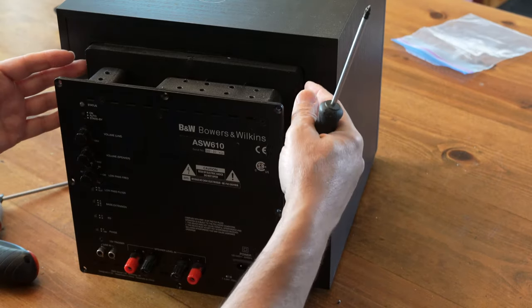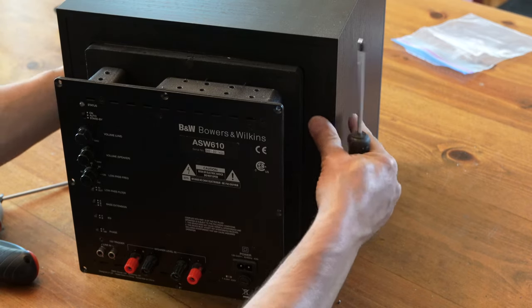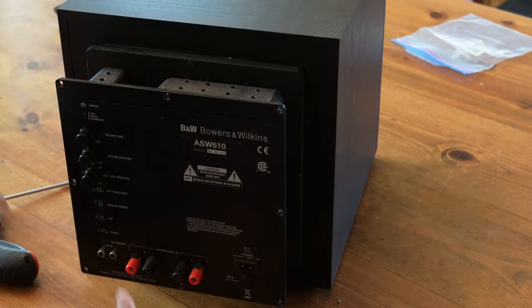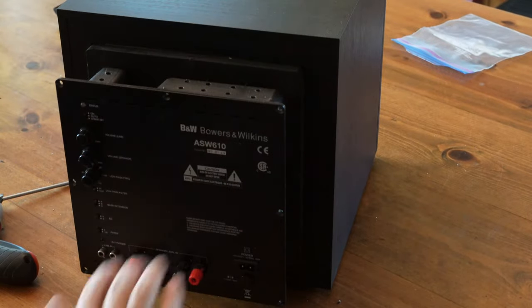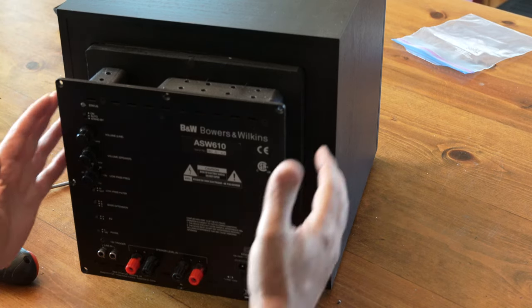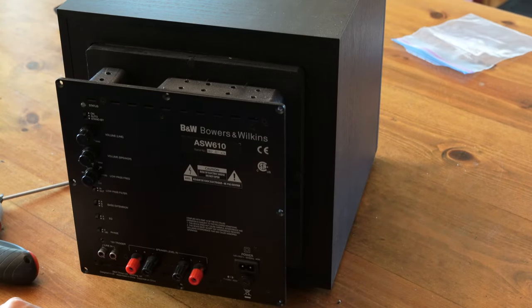The other thing is it's no longer inside being hammered by the vibrations. And the third thing: we gave the volume a little bit more room inside, so we should have a slightly deeper bass. If you don't like this look and you really want the compactness as it was, you just put it back the way it was. In that case I would probably reinforce the plastic and put some acoustic material to keep vibration as low as possible. In my case I opted to make the volume a little bigger and keep the amplifier a lot cooler — this way I'm not going to have it burning again.